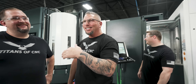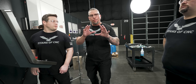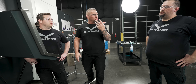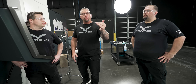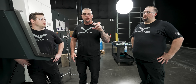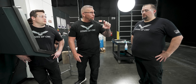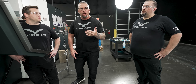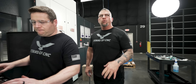I told him what we were just going to do and he's like, oh, beep, beep. Because it's going to be good. This is not safe. We're just going about it a little bit different. So we cut our RPMs in half to grab more torque. The power is pretty much the same, but we got the torque right there. And we're going to slow down to 100 inches a minute, but now we're taking a half-inch radial. So that's like 66% of the tool engaged radially all the way down at 2 inches. That's a crazy cut. So we're going to take this cut, we're going to listen to it, and then from there, we're going to make a decision. That's a big radial for a five flute tool. Nobody would think that it can make this type of radial.